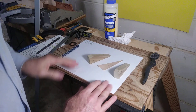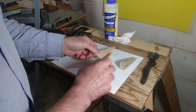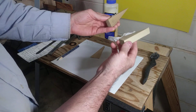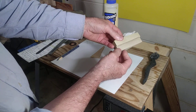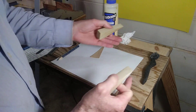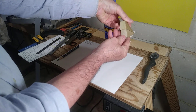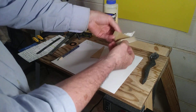I'm not going to try to glue all three pieces up at once. What I'm going to do first is engineer the wood. I'm going to look at the grain of these two sticks and ask myself where I want them in relation to each other. Do I want them like this? This starts when you're roughing out an actual board — a one inch by three, or a four by thirty-two, thirty-six. You need to study that board, look at those annular rings, and ask yourself when I cut this into two or three pieces, how do I want this to come together?